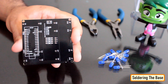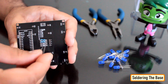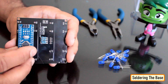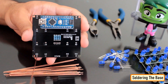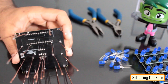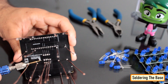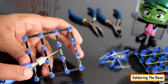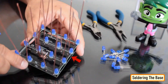After sorting out the top layer, it was time to set up the bottom bit. I started by soldering the 400 ohm resistors to the board, then I soldered the Arduino Nano to the board. Instead of soldering the Arduino Nano directly, I used female pin headers to house it. Please make sure all these components are soldered to the bottom side of the plate. After that, I one by one soldered all the copper wires to the base plate — please make sure you solder them to the top side of the board. After soldering the wires to the base plate, slide the first LED mesh and solder all the wires to it, then slide the second one and so on.